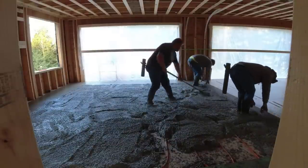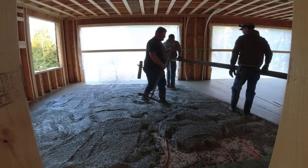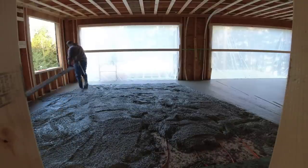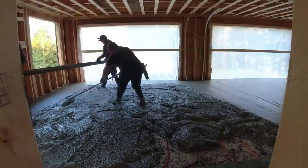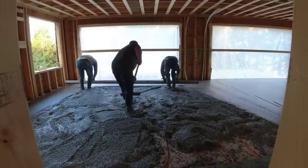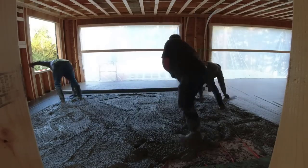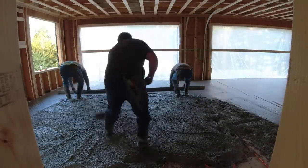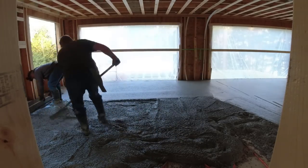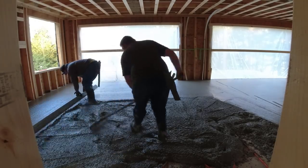When it comes to screeding this concrete at an inch and a half thick, I personally think it's a little bit harder to get it nice and flat — maybe because it's so thin and over the top of those tubes. The tubes are I think five-eighths inch, so you've got seven-eighths of an inch of concrete over the tubing, and you're trying to kick and fill in your footprints as you're doing this and walking over the tubing. I would much rather screed concrete that's four inches thick than inch and a half thick. You can see we've got it kind of high in there and Luke's pulling back a bunch — you don't want to dump so much out that you've got a big high area you have to pull back.